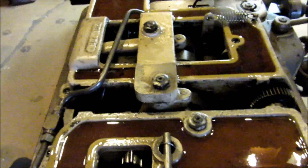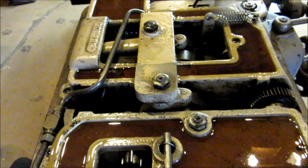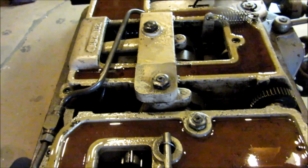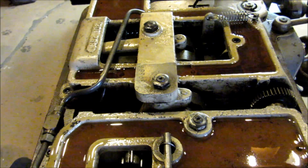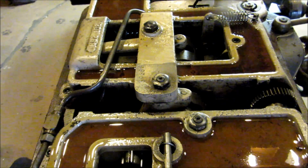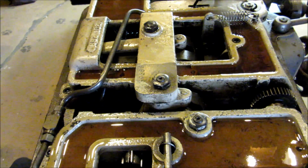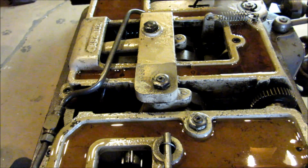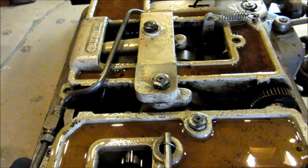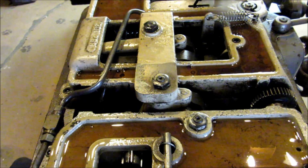Alright, I think you can hear the tick, tick, tick going there. There's a tick in the back. It's slower than motor speed, so I don't think it's the input shaft. I don't think it's the input pulley. Somebody on practicalmachinist.com has suggested that it might be the input pulley, but he said that would knock once per rotation. Well, it's much slower than that, so I don't think it's that.